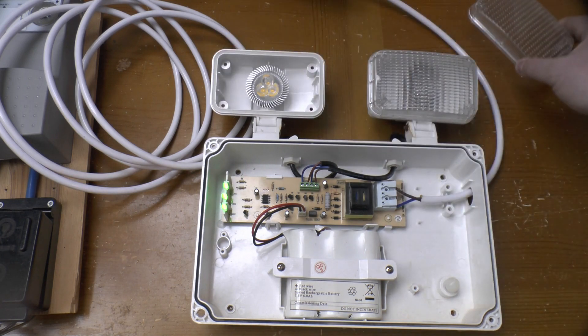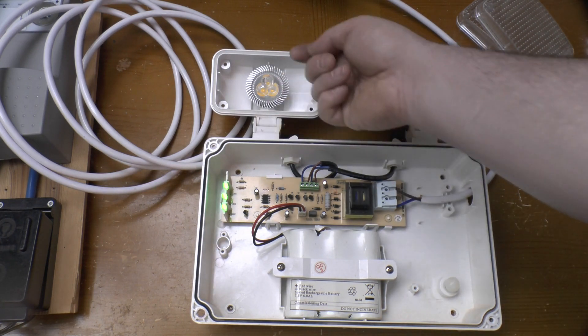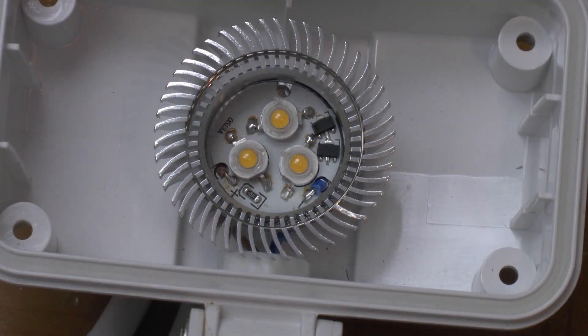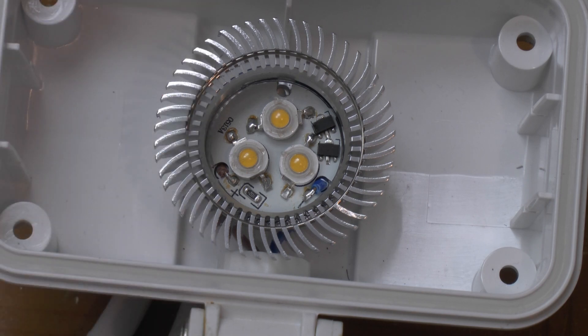Under the lid of each spotlight we find these heat-sinked LED modules, and the cover can be pried off as there's a mounting screw on the back. Popping that cover off reveals three one-watt LEDs on a metal-back circuit board, together with a pair of AMC7135 350-milliamp constant current regulators and a 1k resistor. Presumably having the regulators in the lamp head instead of on the board means the same board could be used with different lamp wattages without redesigning or stocking different board variants. As the regulators are surface-mount devices, it also makes manufacturing the board a lot easier, as that board is single-sided with all through-hole components — having it in the lamp head means you don't need to mess around with surface mount.